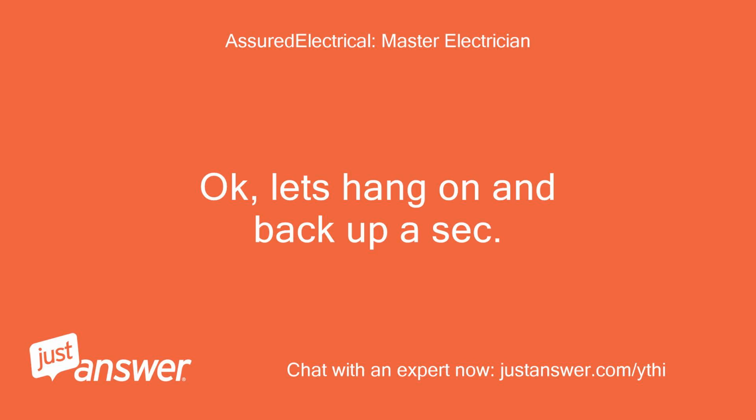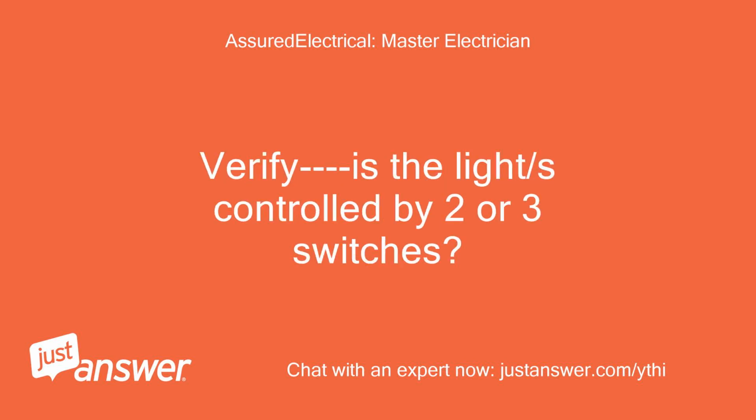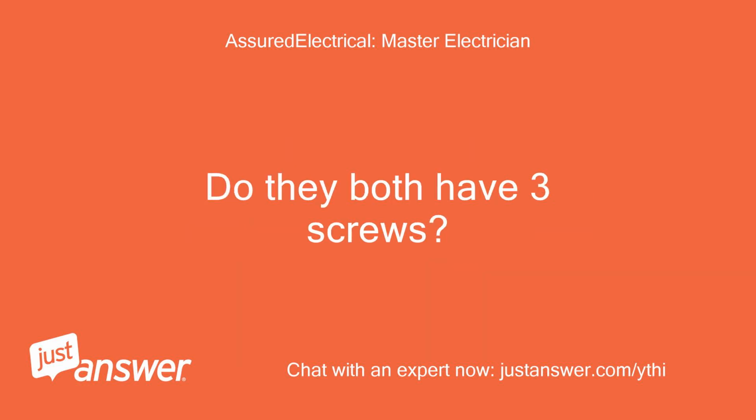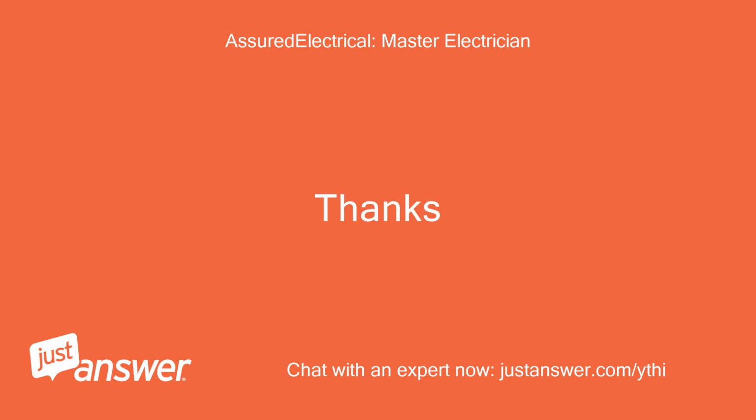Okay, let's hang on and back up a second. Verify, is the light controlled by 2 or 3 switches? If 3 switches, look at the other 2 switches and see how many screws on the switch for wires. Do they both have 3 screws? Thanks.